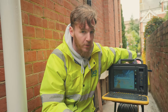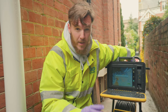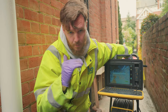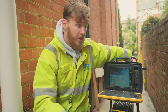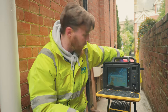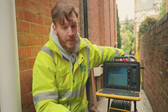Again we're looking for any cracks or displacement. We're in Tunbridge Wells and the drains down here are in good condition — built very well, no cracks, no displacement. So there's no way that water can escape and possibly be causing damp in the garage. So what we're going to do now is survey from this drain down to the one at the bottom, which covers the length of the house and then goes out into the main sewer across the road, just to make sure there's nothing in the main sewer. But so far so good, and there's no reason to believe that any water is escaping into the garage.